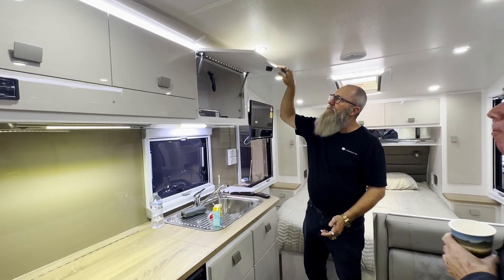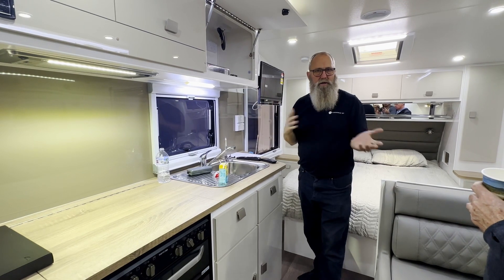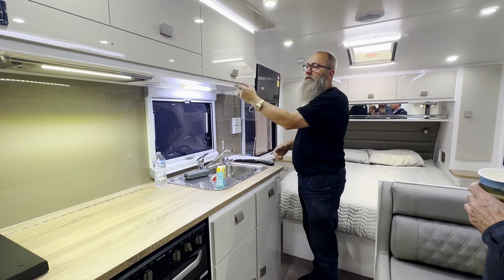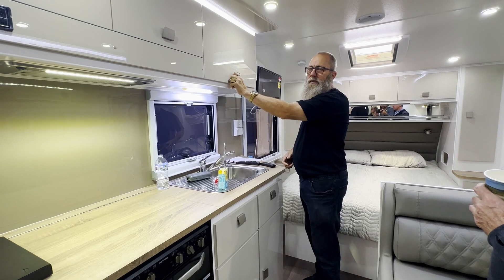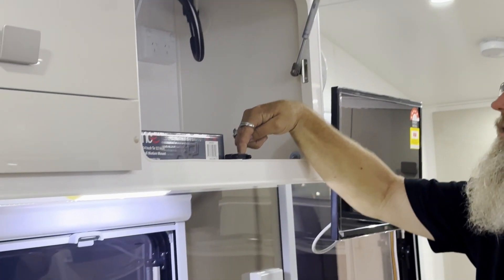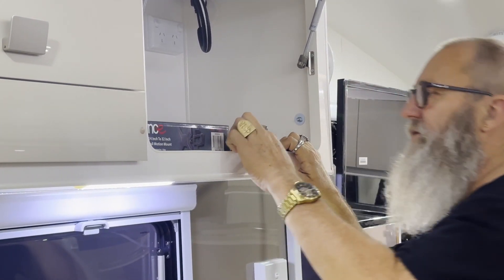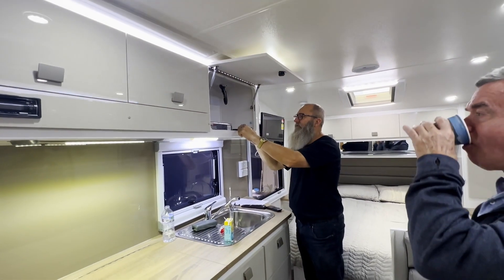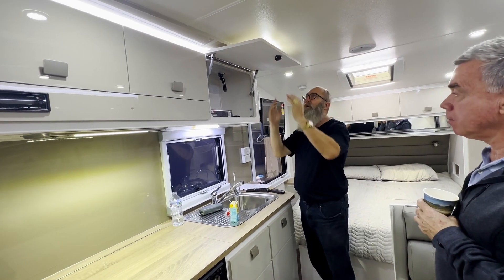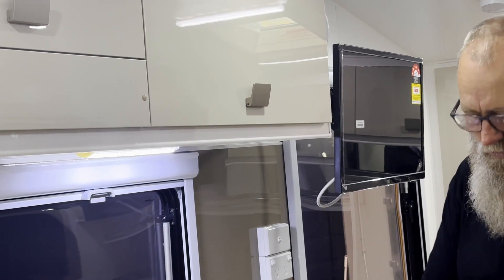These cupboard doors like to fly open. If a door is coming open, the easiest way to test it is to pull on the handle. If it pops open from the bottom, it needs adjusting. To adjust it, there's a little bracket with two outer screws — loosen them off and it slides in and out. Some have a third one in the centre as a lock. It's about four millimetres from here to here. The bracket also has little buttons that keep pressure on the inside to help keep them closed.